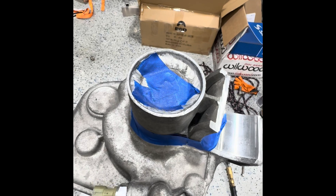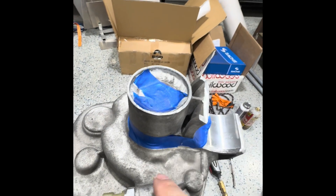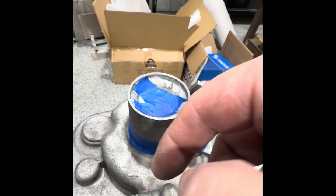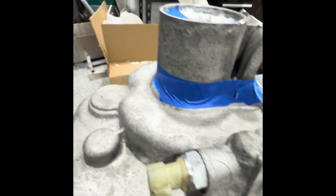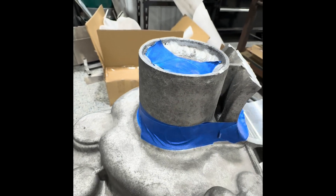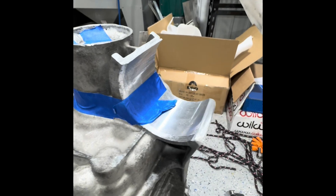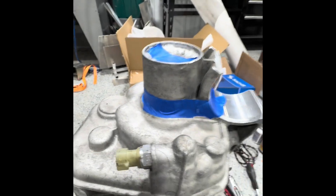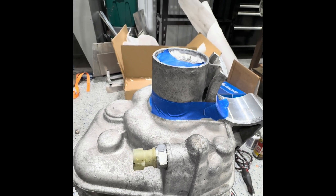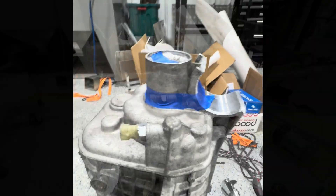Drilled two little pilot holes in the top here so I could put my scope camera down in there. I had drilled one in the center to begin with and I couldn't quite figure out the depth of the bearing in here by looking through the camera. So I drilled one to the edge, hit it with the scope, and realized that bearing sits almost right at the bottom. I'm going to leave just a little buffer and cut from the blue tape up. Made the tape mark so I can keep a nice straight edge. A little nervous about all the debris going inside but that's the cost of doing this — I'll figure out how to clean it out when I'm done.